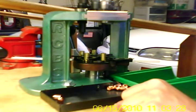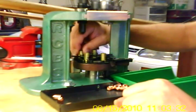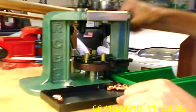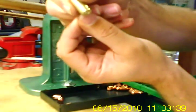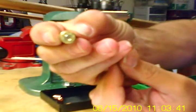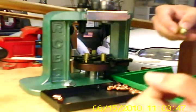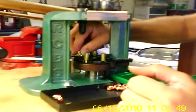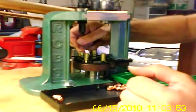At this point I want to verify a few things. First I'm going to rotate it out of the primer station and make sure that primer is flush, if not recessed, with the shell plate. There's no powder in this so you've got to be careful. That's pretty much flush, so I'm going to go ahead and put it back in its station, which happens to be the powder station because I just rotated it. Push the spring in.